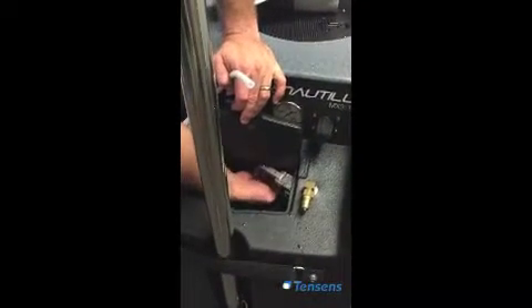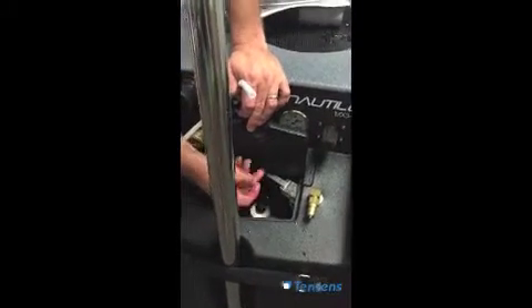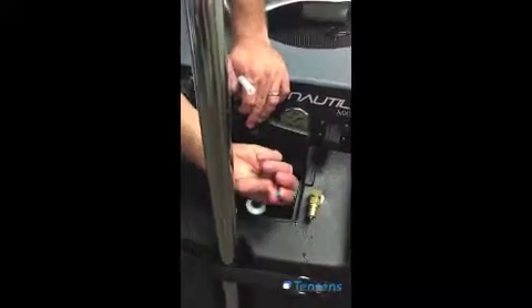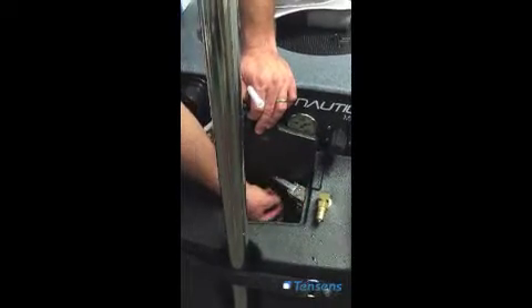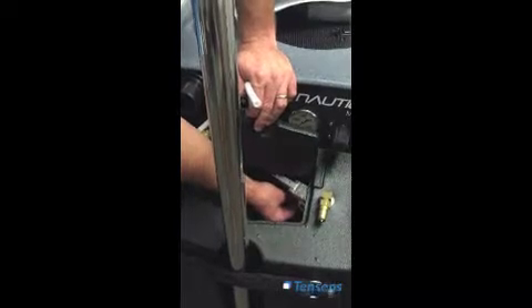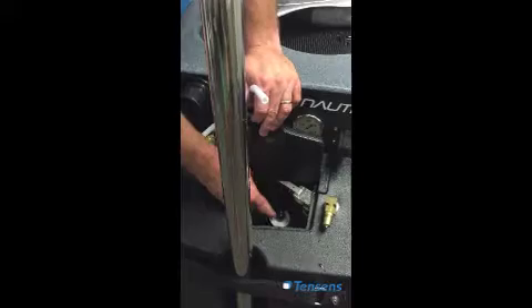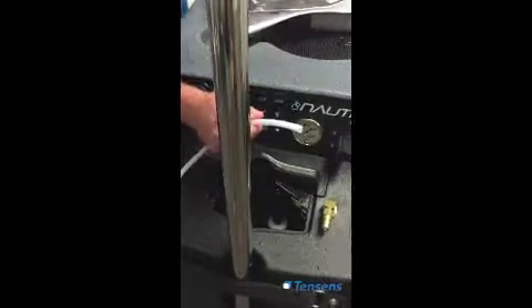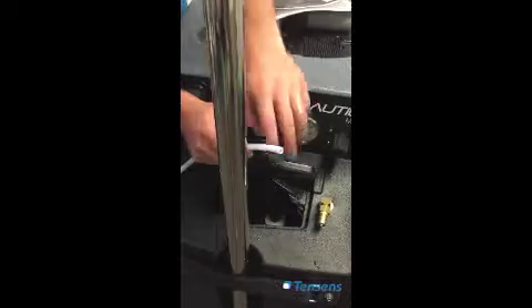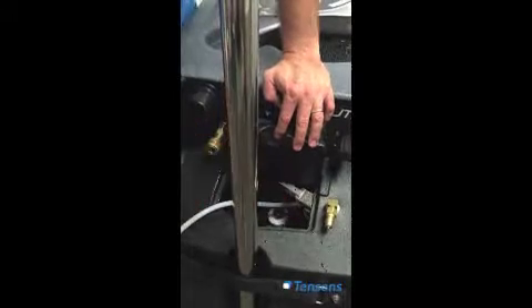Your tips are located in here, and as you can see we have a turquoise tip. If we were to go to our book, the turquoise tip is about 1 to 300. This is actually set for the Hydroforce Groom acid rinse, but if you have a deodorizer that you want to add in here, or a different type of acid rinse, you can change your dilution rate by looking at your chart and putting in the different dilution rate tips, which come with the machine. A real handy little feature.